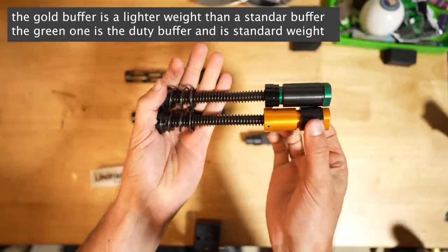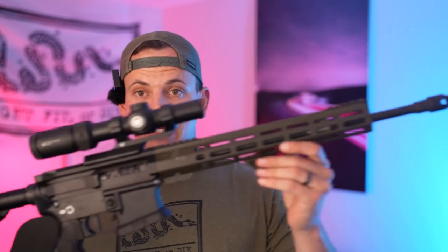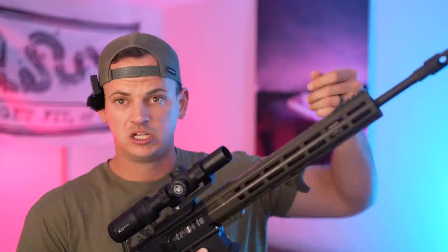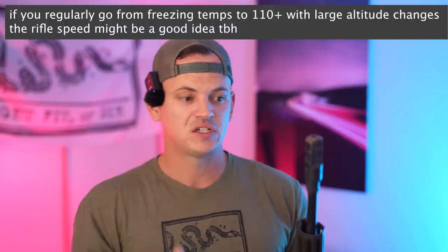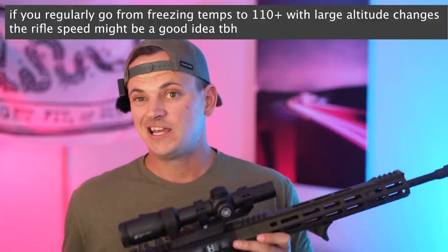Normally you might run into issues stripping rounds from a very heavy spring magazine system, but this works perfectly with fully loaded D60s. Now, we've reduced the buffer weight and the bolt carrier weight — if we do not regulate the gas system to match, we are going to beat this gun to death. So we installed an adjustable gas block. I used the Superlative Arms Click Adjustable Gas Block because it's a pretty good set-and-forget option, but you can still make quantifiable adjustments. There are other good adjustable gas block companies out there; use whatever you've had good luck with from a reputable manufacturer.